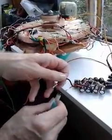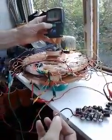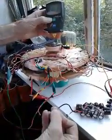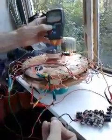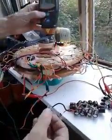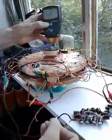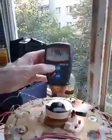Now I'm going to do another one. This is only 1400 µF. We'll just listen to it now — hear it go down. 497, 500. I'll do it. 430, 444. So it does have Lenz's law when it fills up, but when it's a working system outputting, with the cap discharge once every revolution, it'll probably run around this RPM — dropping to 480, 470.